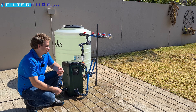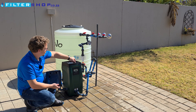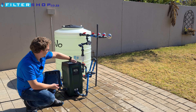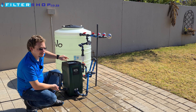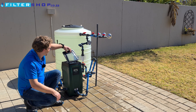With the DAB EasyBox you normally need to prime it. The way to do that is you open up at the top — there's a little tool here, or you can use a large screwdriver — and there's a priming plug you can remove. In our case we took out the priming plug and because our tank's water level was quite high it just ran through, so we ended up not needing to prime the unit.